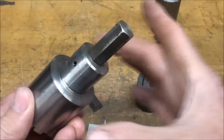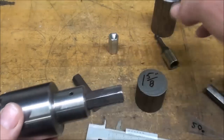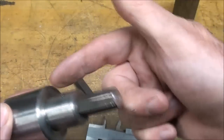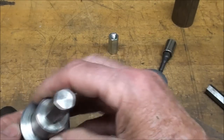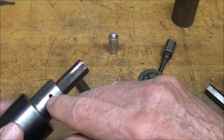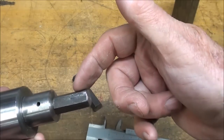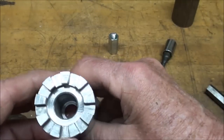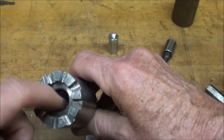In review: this is 1 and 5/8" diameter. This section has been turned down to 1" diameter — though you don't have to turn it down; you could have a little radius or taper it off, whatever your heart desires. That's pinned with an eighth inch roll pin. I turned down the end to 7/16", so there's a 7/16" hole bored clear through to start, then the 5/8" hole, then the 1" clearance hole.